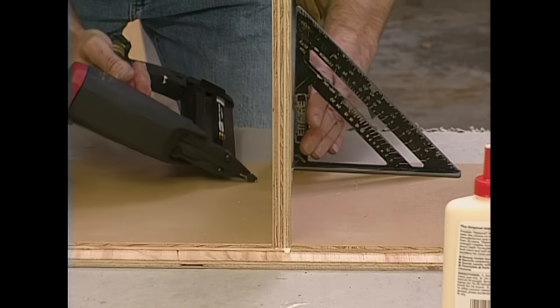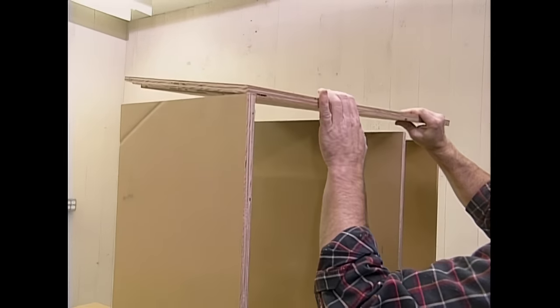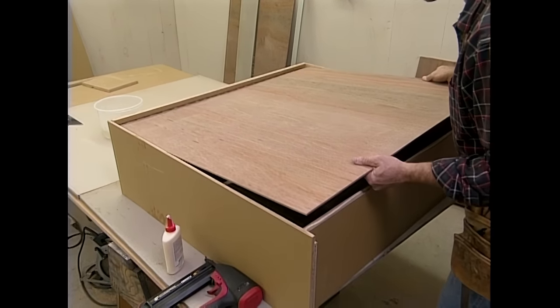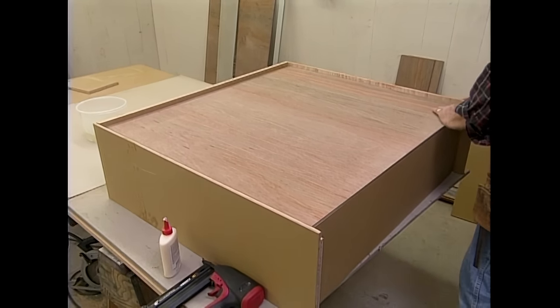For the intermediate shelves, I'm able to just toe nail them. By toe nailing the joint, we have a much stronger connection between the side and the shelf. With the glue installed on the grooves of the other side, I'll just set it on the ends of the shelves and attach it using the same methods. Next, the plywood back — a little bit of glue, slip it into the groove in the top shelf, and then secure it with some three-quarter inch brads. Even though this plywood back is only quarter-inch plywood, it adds incredible strength to the cabinet and support for the shelves so that they don't sag when loaded down with heavy objects.